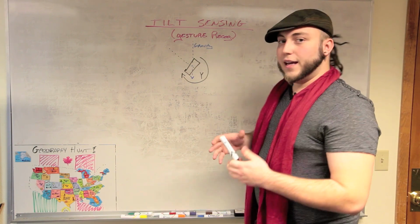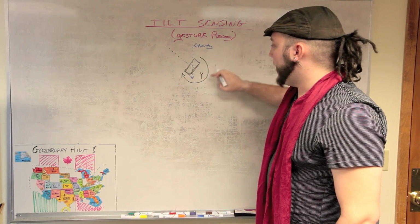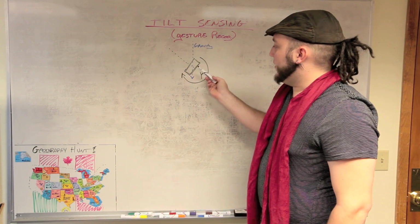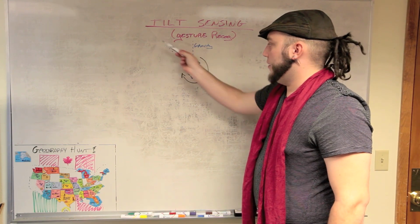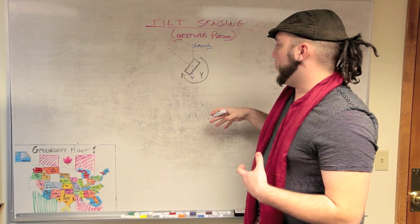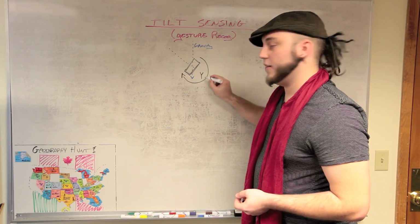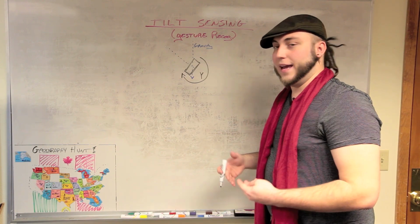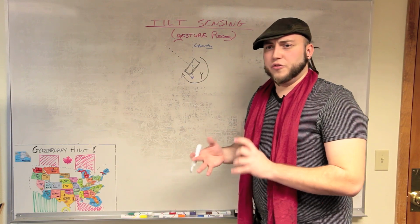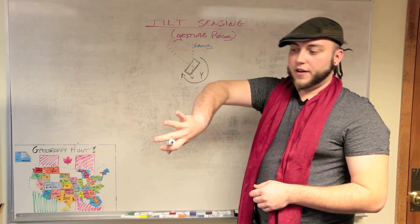If you're looking at one of these devices from the side, you sort of have a box like this, and if you're rotating it around, say, the y-axis in this example, you can imagine that there's a line sticking straight up perpendicular to the top of the device, and that's sort of your center point for where all your measurements are going to come from. The way that the one I'm using works, it spits out an analog voltage relative to this position. I'll get numbers back through my analog to digital converter on the Arduino that float around 500. So 500 is sort of my center point. Numbers higher than 500 are one direction. Lower than 500 is the other direction.